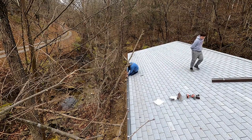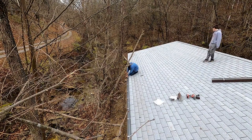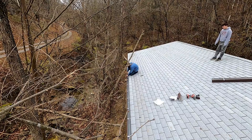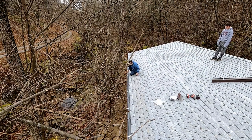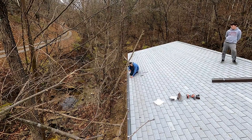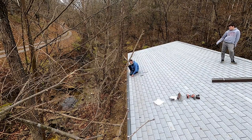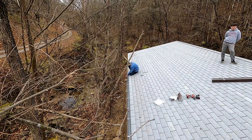What's so good about that? It's just an adhesive, or glue, that stays somewhat flexible. Because these are aluminum, they will expand and contract with heat, plus with the building. If the adhesive was strictly solid or dried hard, it would crack and start leaking. So if it stays flexible, it moves with the gutters. Like that silicone stuff? I don't know if it's silicone or not. It's something like that.